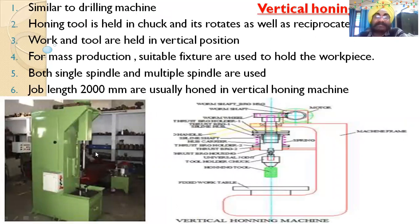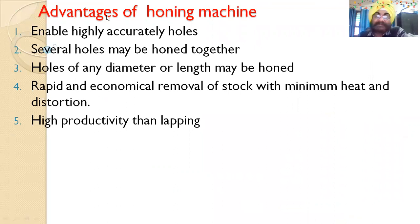For long jobs like gun barrels — the internal hole through which the bullet passes — a horizontal honing machine is necessary because manual honing would not give sufficient precision. In horizontal honing, the spindle runs on its own axis driven by a V-belt, and the workpiece is mounted on a precisely marked table with cutting oil applied continuously. Reciprocating motion is not always necessary in horizontal honing. Vertical honing machines work like a drilling machine, where the tool both rotates and reciprocates.